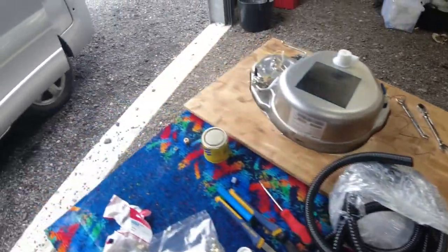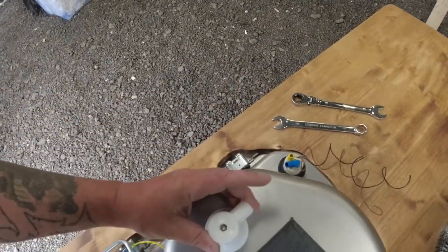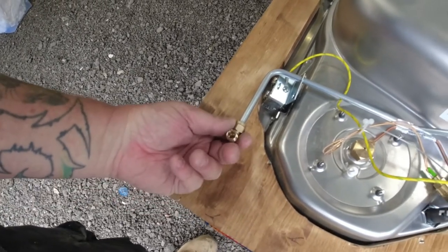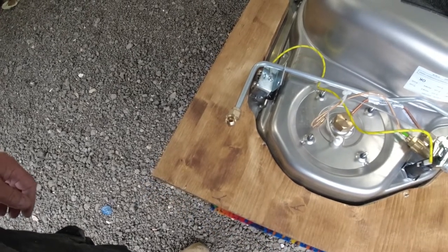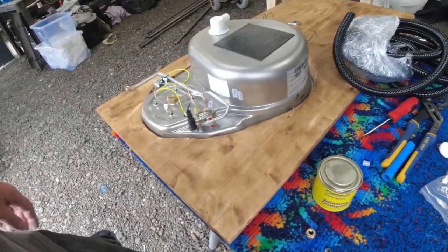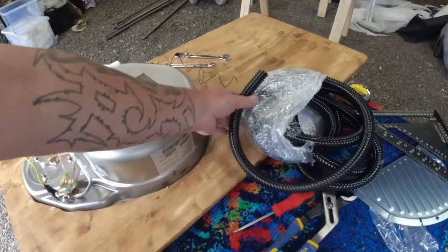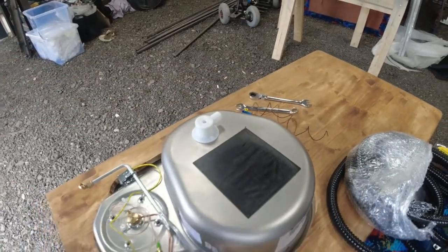It's upside down at the moment because I've now fitted in the tap, the waste, and also I put an elbow compression fitting on the end for the gas hob. And as with all these joints, I always use jointing compound. So I smell like a plumber at the moment. And obviously there's the waste hose, which will connect on there. But yeah, it's looking rather nice.